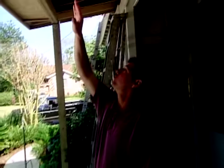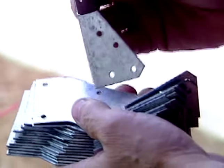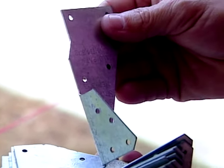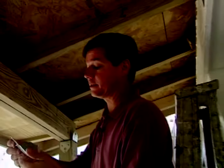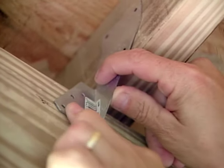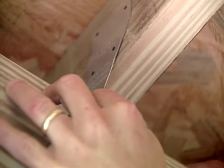Now, before we actually put a soffit under here, we need to really consider, this is Florida, so we'll put a hurricane clip on these. I'll kind of show you where they go, just for security. It's code that we basically clip these on, okay? They get put right up here on the side and down on this header to keep some of the upwind draft from ripping off this roof under a heavy storm.